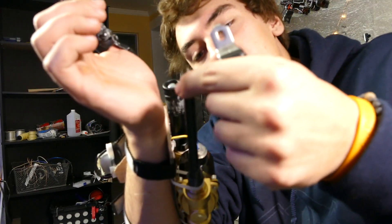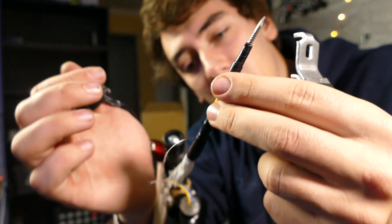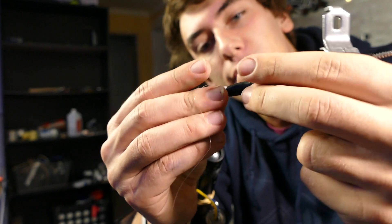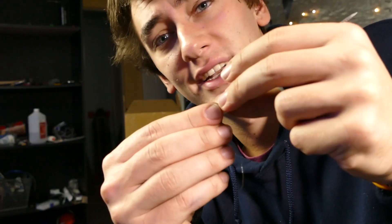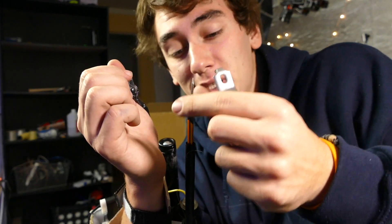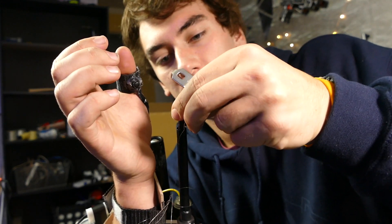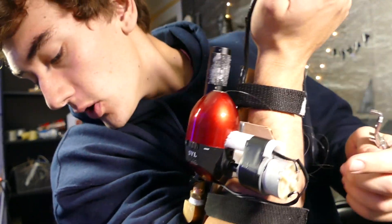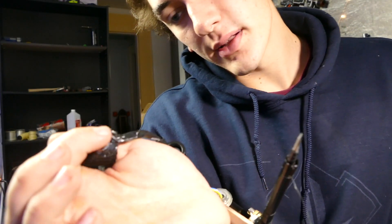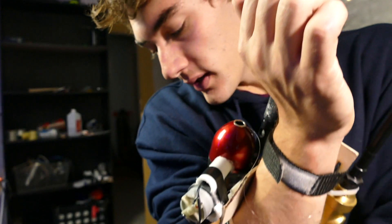We've got the barrel, and attached to the barrel we have our dart — a modified crossbow dart. Added a nail to the tip for better penetration and a little bit of fabric on the end for extra stability during flight. Is it really a JLaser project if it's not mounted on your wrist? That slides down into this barrel, which is made from a barbecue lighter, believe it or not. Once it's fired, we can retract it using this fishing spool attached to this geared-up motor, also controlled by the thumb ring — a little momentary switch. One button for the firing mechanism and the other for the reel-in.